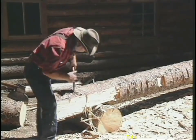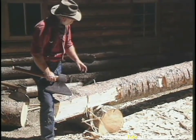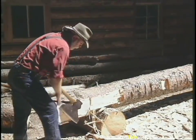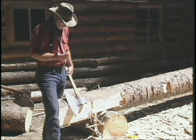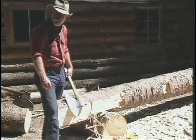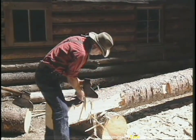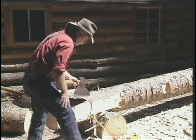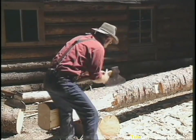The work leaves a fairly smooth surface with just a hint of the scoring marks left in it. When using the broad axe, if you miss — especially on thin shavings — sometimes the axe will go on by; let it go on by. Don't let it go into the dirt and rocks. The wood chip buildup will save the edge. Don't try to pull a missed shot. These axes are heavy enough that if you do it all day long, your forearms will be burning — it's mostly forearm work. If you get a chip stuck on the axe edge, stop and remove it, otherwise you'll get a glancing blow. Keep this leg tight and the other leg out of harm's way.